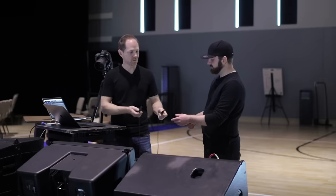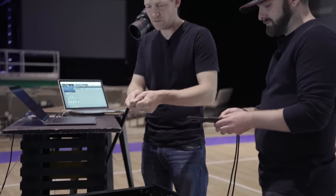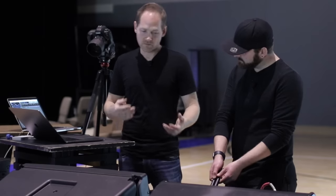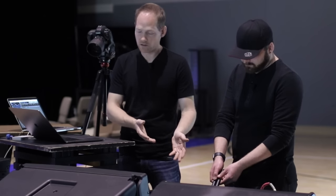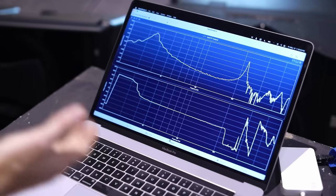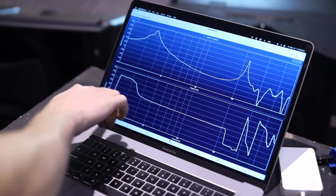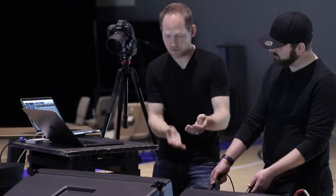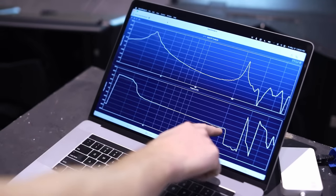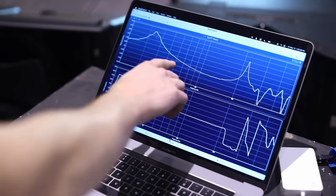I'm going to give you these two microphones. The one in your left hand is going to be the reference and this one is going to be what we're testing. Go ahead and put them together right in front of the speaker — we're going to run some noise through the speaker. On the graph you can see both lines are flat because they're comparing each other and they're picking up the same sound so there's nothing to report. Take the one in your right hand and move it to the vent so we can see the graph change. Now let's look at the bottom graph — below the tuning frequency of the cabinet it's up around 180 degrees because they're doing that push-pull thing, right? And then as the frequency increases it goes through the resonant point of the cabinet and now they are in phase, so with these frequencies they're going to be moving in unison and they'll stack together if they're relatively the same volume.